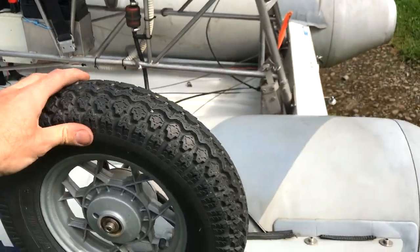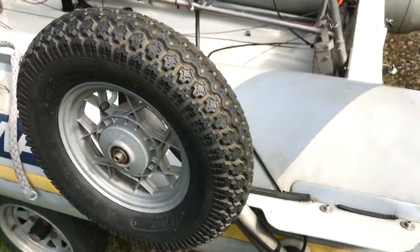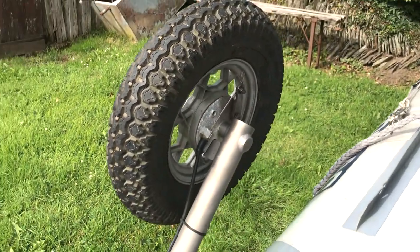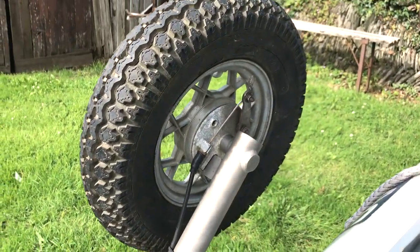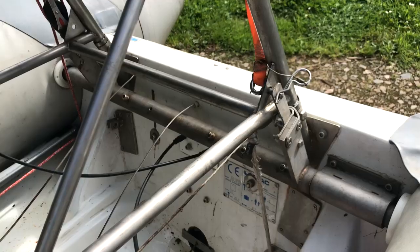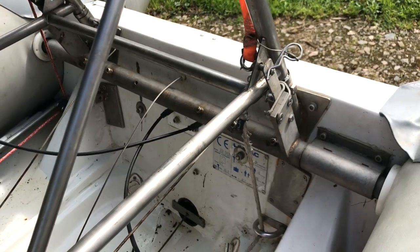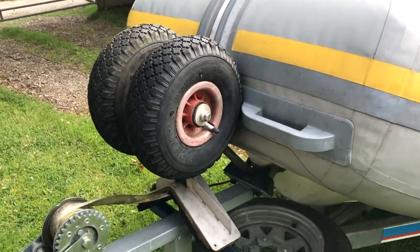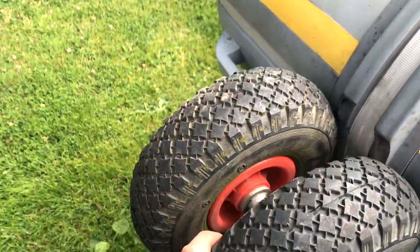As mentioned, this is amphibious, so it also has retractable landing gear. You can take off from a runway and land in the water, or vice versa — pretty neat, huh? The rear wheels have brakes, which is how it's steered, and they are retractable by pulleys and ropes. The nose wheel is the same and it's just on a dolly-type hinge.